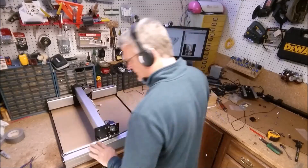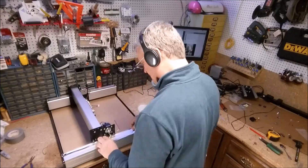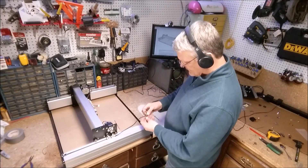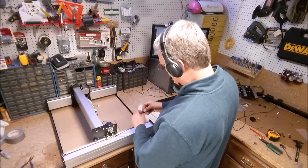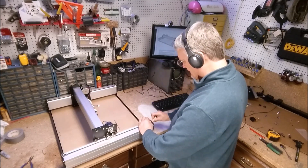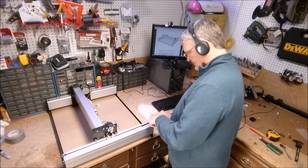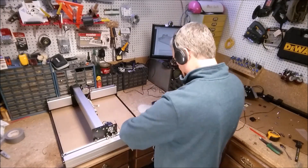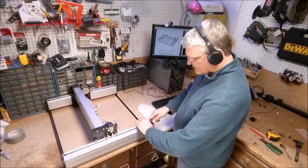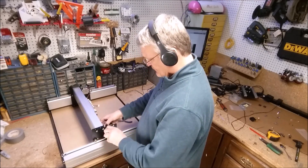Now it's time to install one of the y-axis belts. After measuring the rail and marking the center, I moved the trolley over the mark and kept it as close to that spot as possible when clamping the belt down. The belt runs from one clamp, through a belt guide, then up and over the servo drive wheel, through the other belt guide, and into the other clamp. After you get the belt on and snugged up with the clamps, adjust any remaining tension with the servo. You want it snug but not really tight, so you don't risk wearing out any bearings on the servo or the belt guides.